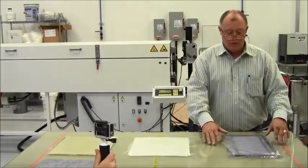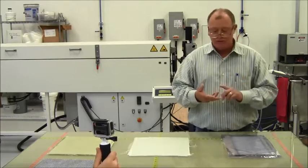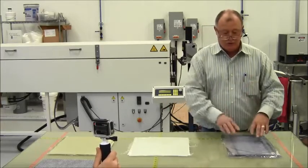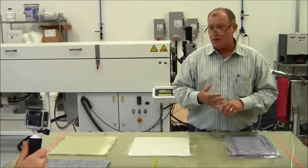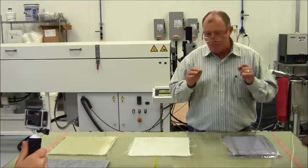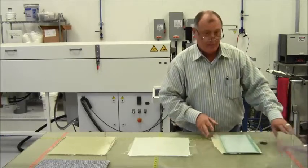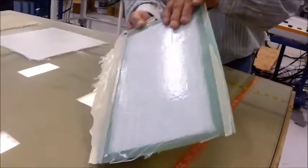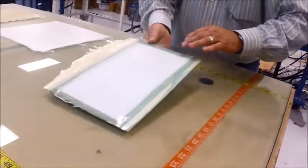We did a panel of Enegra with epoxy to emulate how you would hand laminate onto a surfboard or a stand-up paddleboard, or if you're just doing an outside topical aesthetic application of the material to your parts. On this one, I applied a light bag film to the top and squeegeed it so that I could get a more resin-rich surface, which would allow you to sand more easily and give you a much cleaner surface to start with, then come back and clear coat with the absolute minimal amount of risk for damaging the Enegra fiber. You can see that it's very smooth and will be much less problematic in terms of trying to fill pinholes and voids before you get ready to do your clear coat.